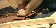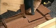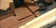This forms a diverter that takes the water out past the chimney corner — this is an important detail because all the water behind the chimney drains here. To get the end of this flashing to lie down on the tile beneath, make a little relief cut, and that will free the end to take the shape of the cap section beneath.